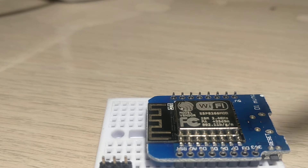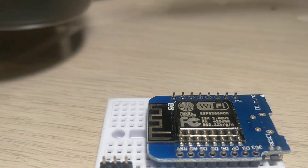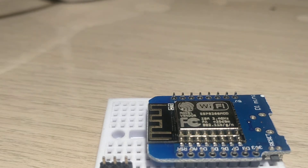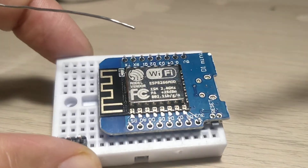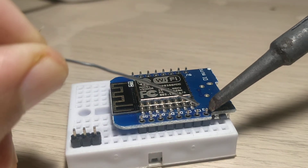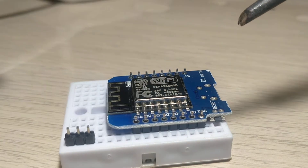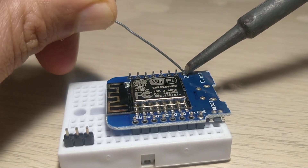What I have done is I have taken a soldering rod — a typical Stanley soldering rod. I will just clean this up and tin it. So this is the trick here: take it here, heat the pin and let the solder flow in. Voila, you are done. The first soldering is done. Similarly, make sure you do it on the other side. Pretty straightforward.